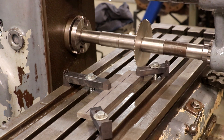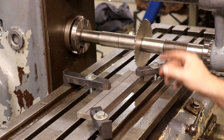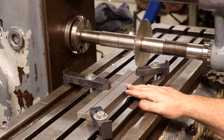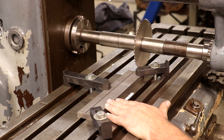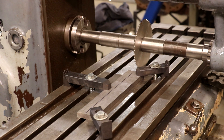I did my math on here. I used a little slide rule from Kearney & Trecker to help figure out feeds and speeds. I figured up on cast iron the surface feet per minute for this six inch cutter — it came out ideally to around 65 RPMs. On the mill I can choose between 57 and 75, and 65 is almost right in between. I opted for the slower 57 to be conservative. As far as feed rate goes, according to the math I could do about 30 inches per minute, but I'm not in a hurry. I've got it set on 10 inches per minute right now, so let's fire it up.